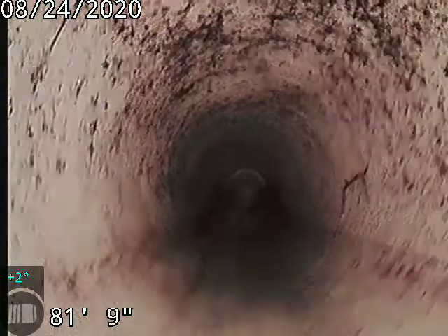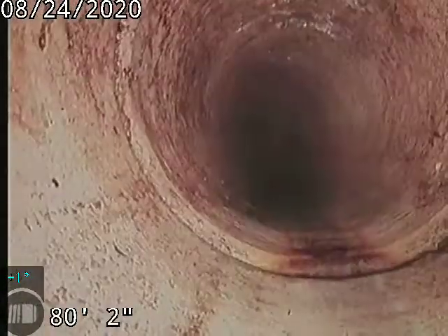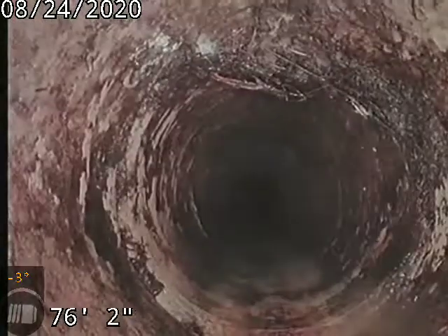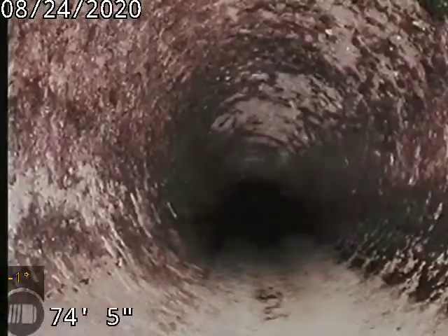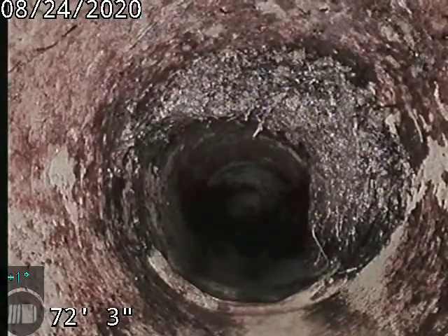Did clean the line with 3-inch double knives. This is a 4-inch clay tile pipe, so we are never going to get a hundred percent of the tree roots out. It is a 3-inch access, so we can only put in blades big enough to fit down the access. So again, 3-inch access and it's a 4-inch pipe — you can see roots there.